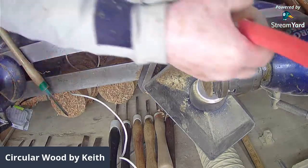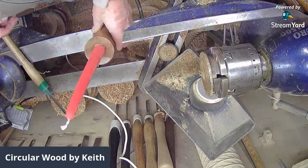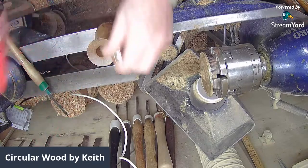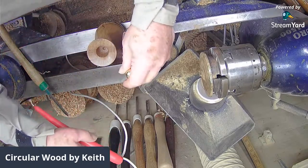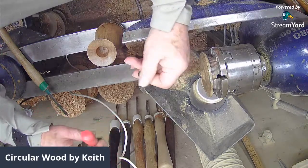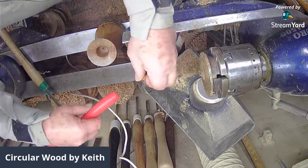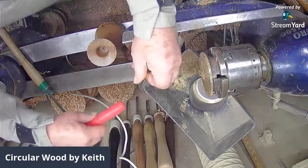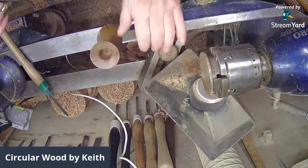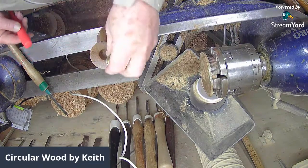Yeah. You can overcome that problem by using a hot air gun to remelt the wax and let it absorb into the wood. That's what Martin does. And the other thing about the microcrystalline, it's more resistant to touching. So it's an item that's going to be moved about. Yeah. It was developed for museums so that they could coat a lot of marble and stuff like that, so that everyone who goes past and fondles it doesn't damage it. So it was developed in collusion with the museums.